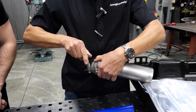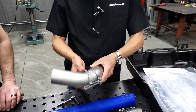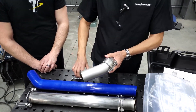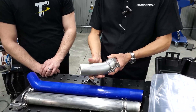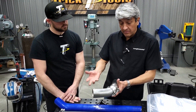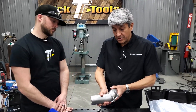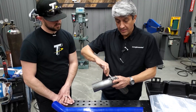With a gapless joint you can just do a quick fusion weld. This can even be worked in the car when you need to tweak just the endpoint. When you're done, just tighten it up — rotation adjustment is really simple, just loosen slightly to make minor changes. In the past without the clamps, you had to witness-line it, and if it didn't work you wouldn't find out until the end, then you'd have to break it apart, clean up, and do it again. This way you can make very small changes and test until the ends match, then commit to the weld.